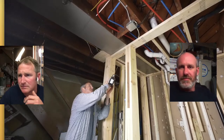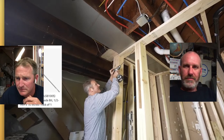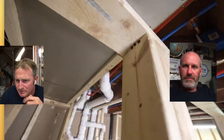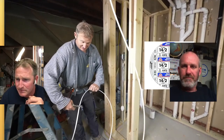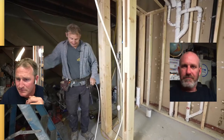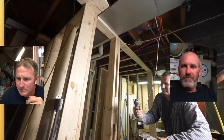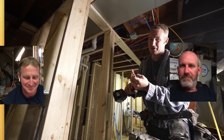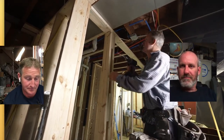So we've got a 15-amp line — this is going to be for our vent fan and lighting. These Diablo demon bits are like a spade bit on steroids. If you hit a nail it shouldn't dull right away, and it really makes it easy to cut through. This 20-amp line is going to go to my outlet.